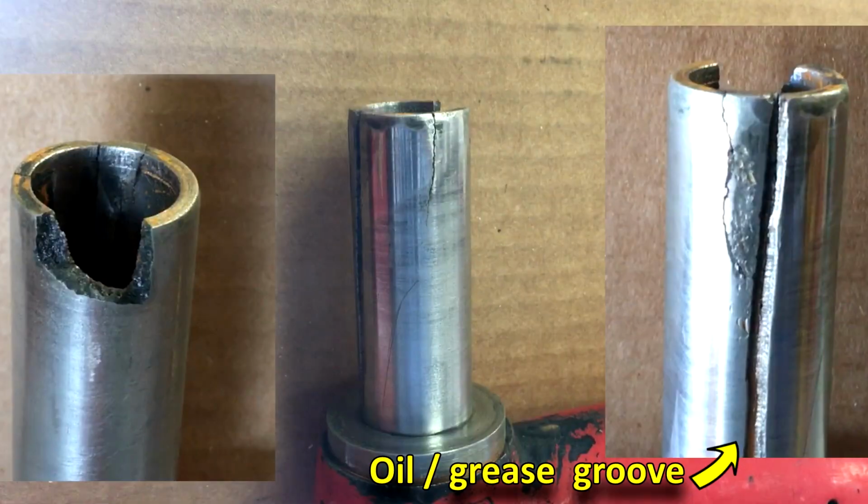At the very top of the column, there's some damage to the guide for the spindle. There's a little chunk out of it and a couple cracks. There's about 6 inches worth of bore that guides the spindle, so I don't think this top portion missing will be detrimental to it. And if I ever decide to, I think I could press this whole sleeve out and turn up a new one.